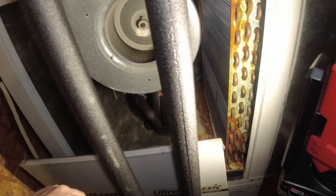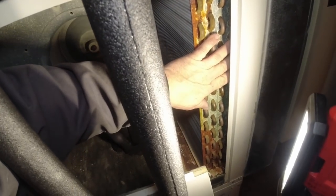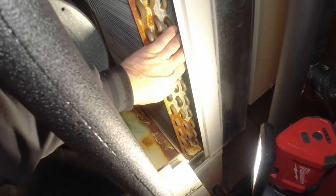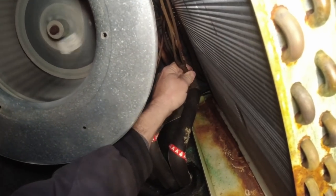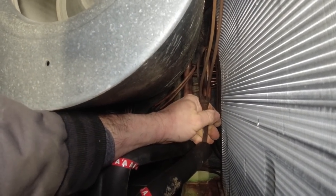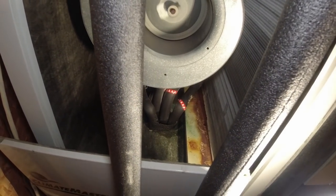Circuit A is running and we wanted to know whether it's putting out heat. The evaporator here does not have any noticeable heat - your A circuit here, I don't feel anything on it. Coming back, this should be your hot going in, it's not very hot at all, it's warm but it's not hot. Coming back could be low on charge - I don't know exactly what's going on. A is the problem one; B is supposedly working right but we don't know that for certain yet.